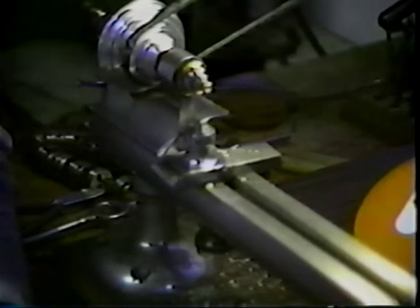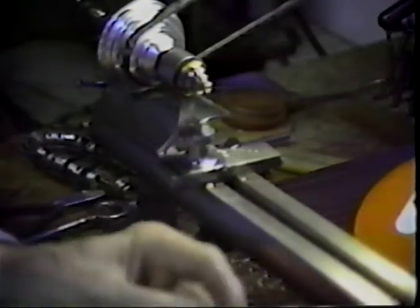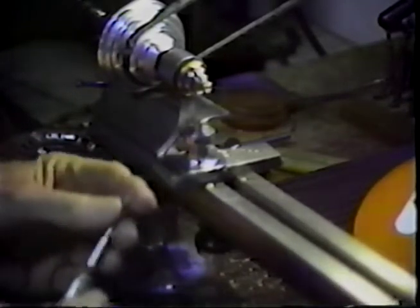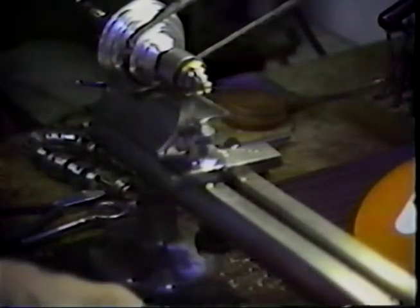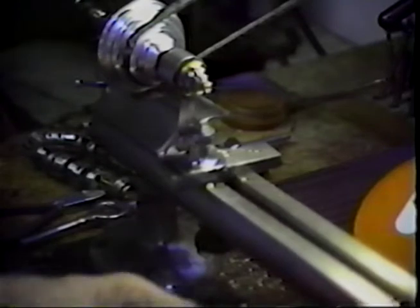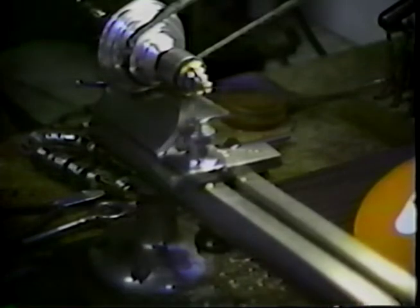The purpose of these V-shaped grooves — they will be like threads, except not one continuous spiral. It'll be three individual grooves. When we go to knurl this, we'll cut the knurl crosswise across these grooves. That gives it a series of tiny points in circles around the nut. Let's find a tool bit that has about a 60-degree angle on the end so we can cut those grooves.